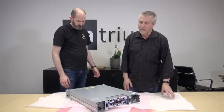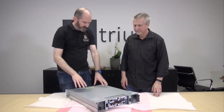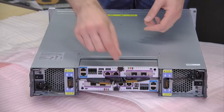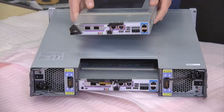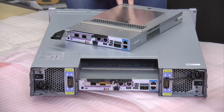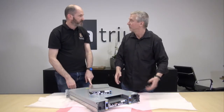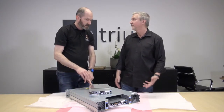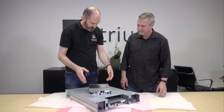There are a couple of things that are field swappable and replaceable. The main chassis stays closed. At the back we have the controllers — they just release out, and there it is as a solid unit. This isn't field serviceable — this is just replacing the field unit and sending the faulty one back. The system can run on a single controller, so if one happens to fail, you don't lose access to the box. You just have to get it replaced relatively shortly, because your redundancy is reduced rather than your operation being affected.